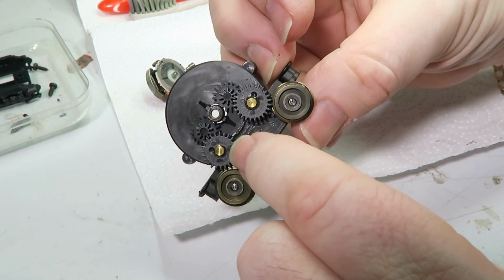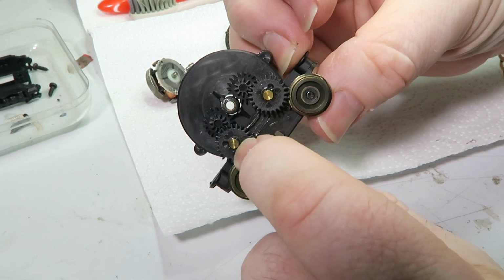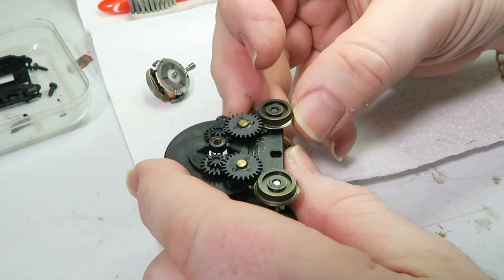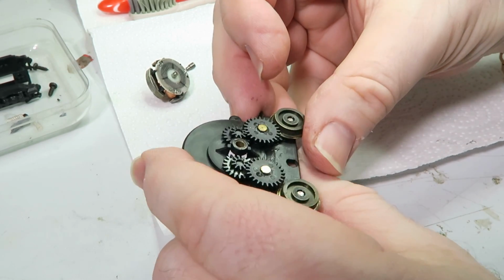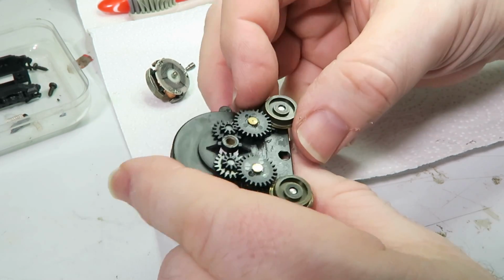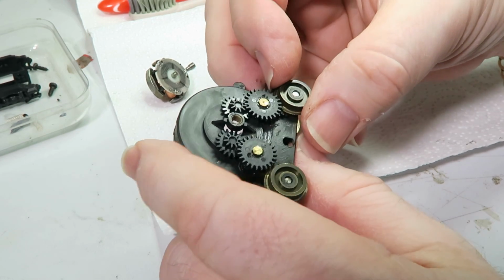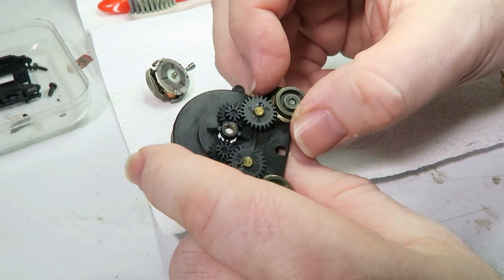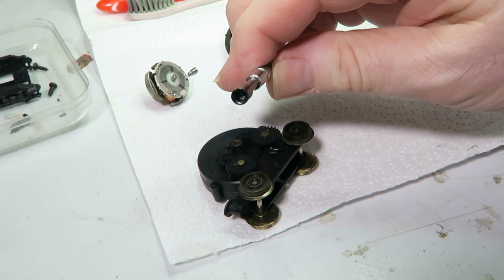Now then, these little nuts are almost impossible to get hold of nowadays. Some people may still carry them, but I haven't found a good supplier. So we're going to use a nut spinner to take them off, and when we put them back, we're only going to put them back finger tight, because you don't want to strip the thread. It's very easy to do. Nut spinner.